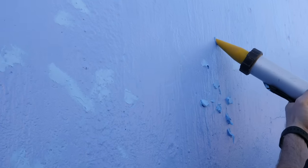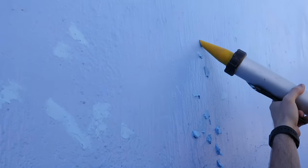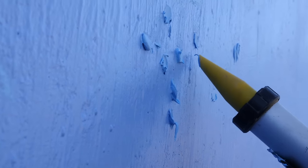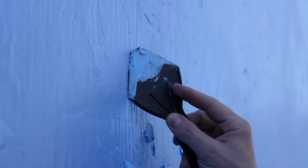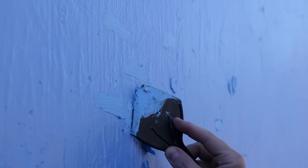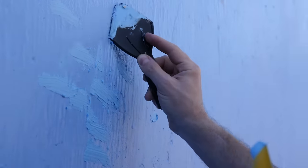Before we get into that, what's the first step now? We're going to come back through and find any imperfections in this sheet good. We'll use the 2200 to fill any holes, pock marks, anything that didn't get a complete fill. Because it's really important that this becomes a unilateral sheet to make sure that no water has any chance to get in. Water is the world's greatest solvent, so you can be assured it's going to find a way to get in if you don't fill it up.